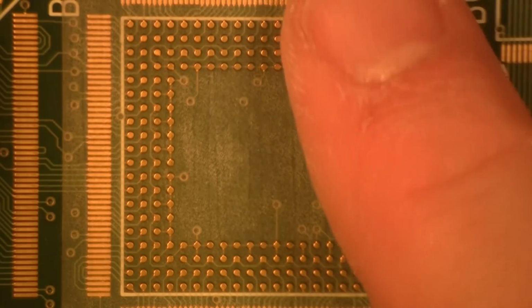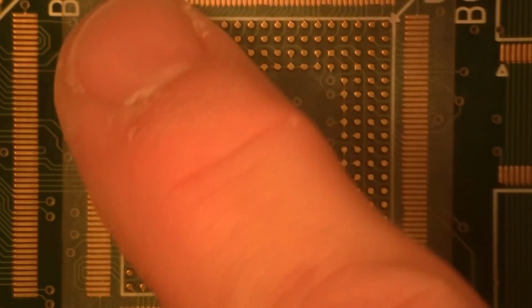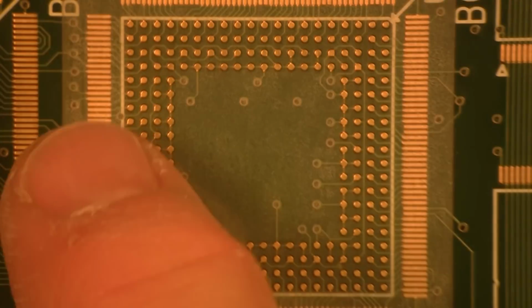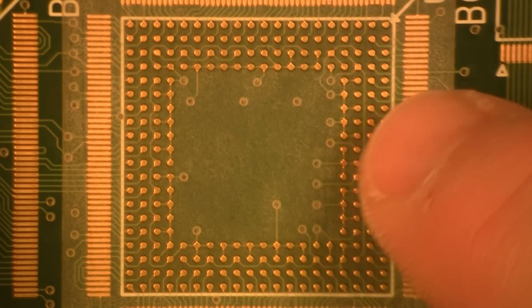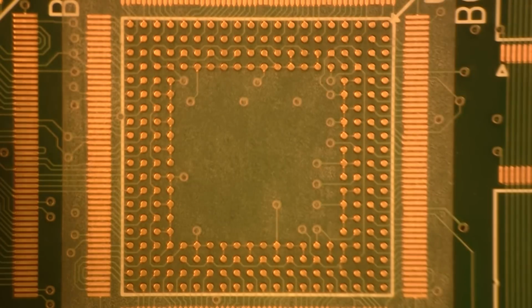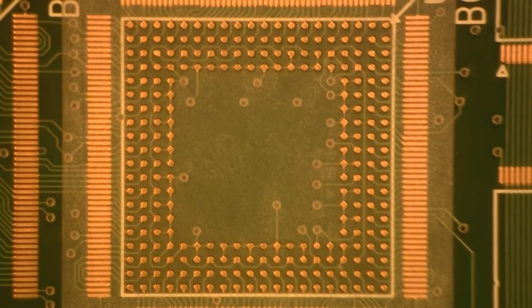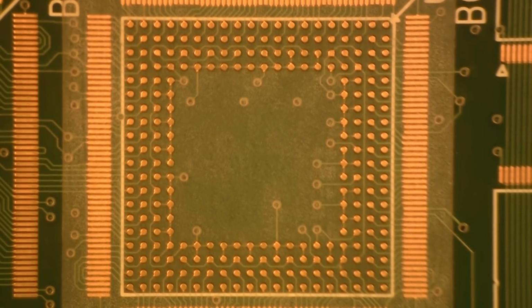And then what I do is I slightly rub it right here in the center. You don't need to rub the outer edges. And we oversize these outer edges, so when we squeegee across here, the solder paste won't go out to our board itself. It will stay on here, and when we peel this back off, all of our residue is still on the stencil itself.